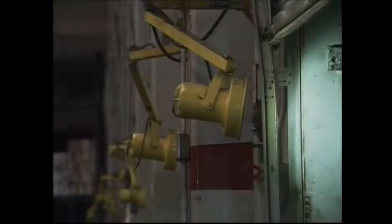Dock plates are used to provide a smooth surface when crossing between the dock and trailer. Make sure the dock plate is in good condition and is properly placed between the trailer and the dock to prevent movement of the dock plate. Make sure you have adequate lighting to see where you're going. Of course, make sure the truck or trailer floor is safe to drive your forklift inside.